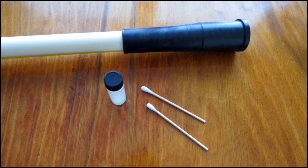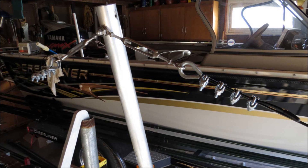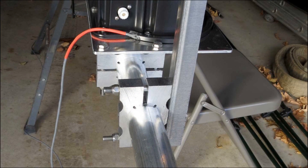There are just a couple of additional steps before we mount the antenna to the mast of the tower. First we are going to assemble the 6 meter passive element, which consists of three pieces of aluminum tubing, a mounting plate, and a clamp to attach to the boom. Next we assemble the boom truss, which is attached to the mast using thimbles, U-bolts, and turnbuckles. And finally we will mount the element truss kits hardware to the boom of the antenna.